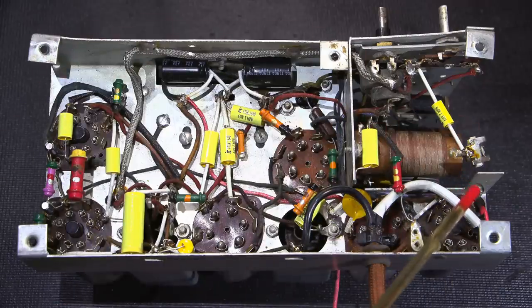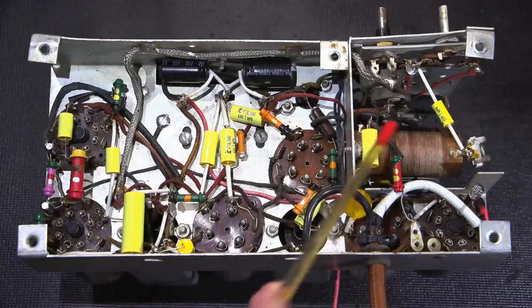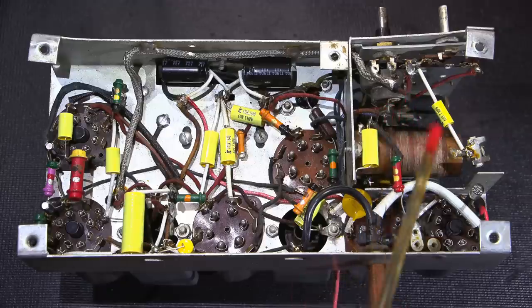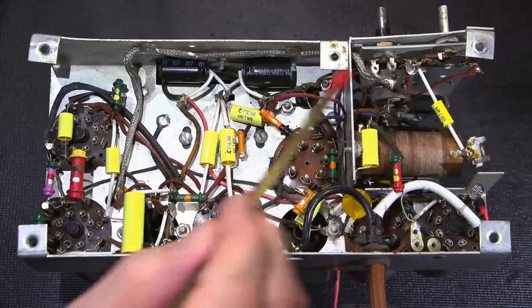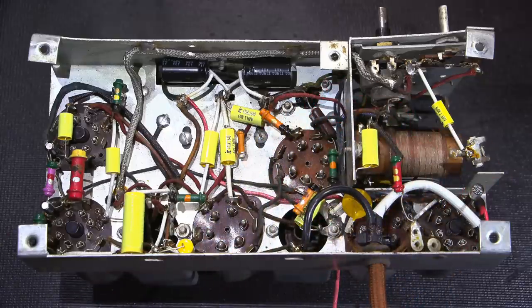important to put a fuse in the radio, especially when it's rewired and the switch itself has the hot running through it now. So this has been rewired and the hot now goes through the backside of the switch and comes over to the radio.